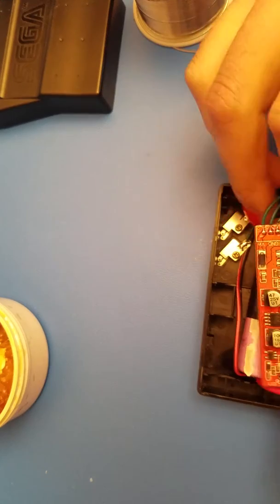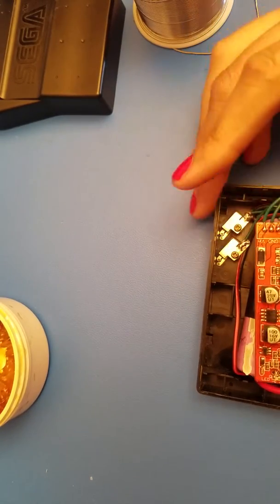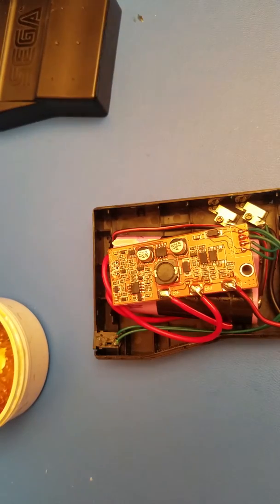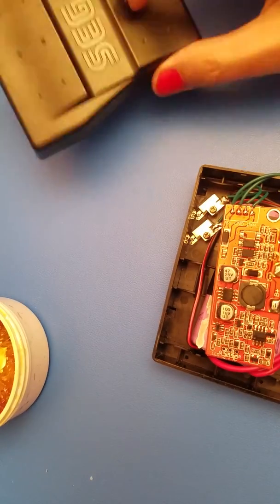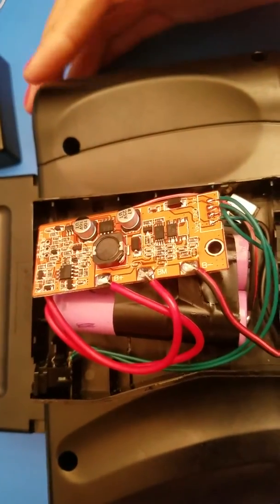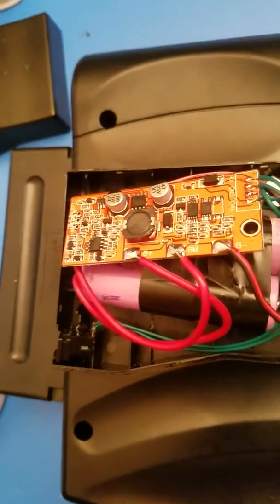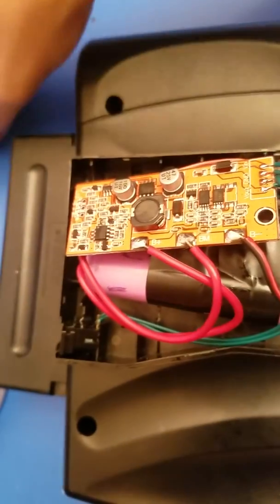You can work that jack back into place where it's supposed to be, and that is completing the setup. I know it looks not so pretty, but you honestly have so much room to work with. Now you can put your Sega cover back on the top half and plug it into your Sega Nomad. One last thing to cover: I did have to make one adjustment — the two green wires right here needed to be switched, as they were actually reversed. But other than that, this is how you would mod your Sega Nomad pack to be rechargeable. You'd end up putting this back on, sealing it however you choose, and that's all.